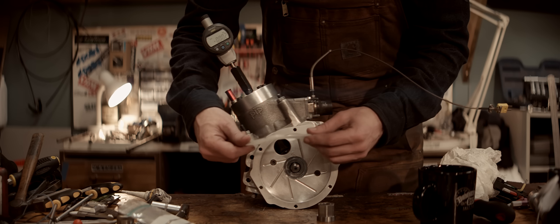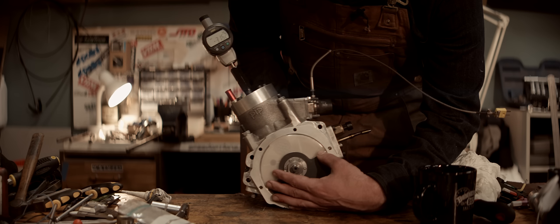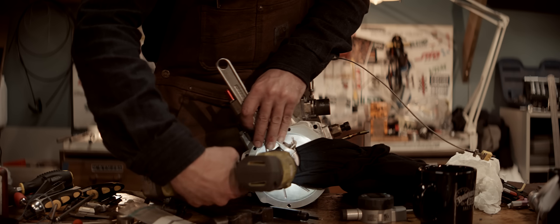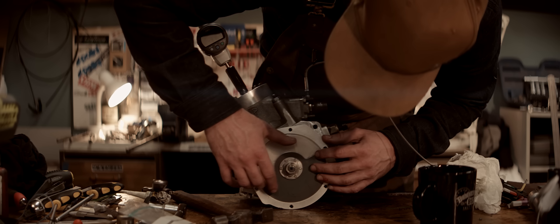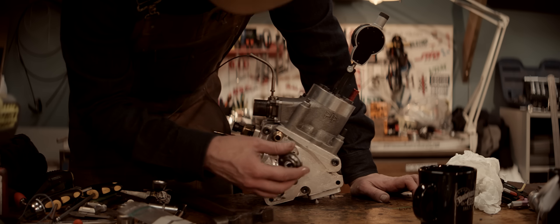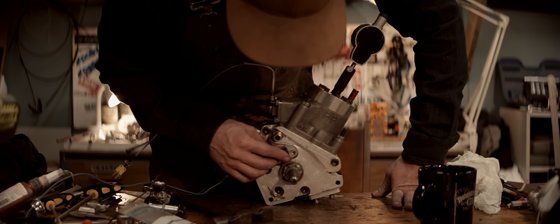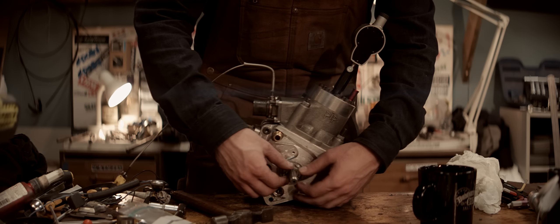As you've seen before, I'm using this 3D printed template thing to set timing - both rotary valve and ignition timing. To seat the taper, that's enough. That's pretty much spot on, sitting at 3.17 and the crank is spinning this direction. Now the end of the lobe should be centered over the trigger - you can see the end of the lobe is centered over the trigger, so it's in the correct position now.